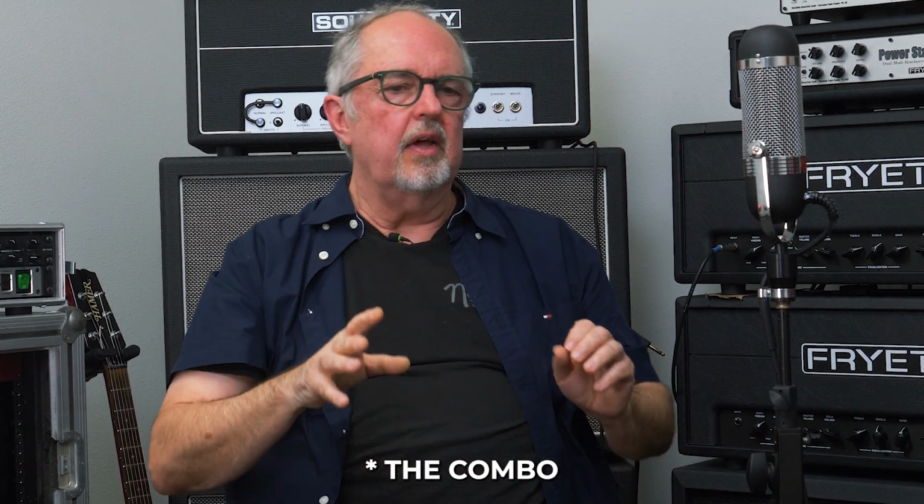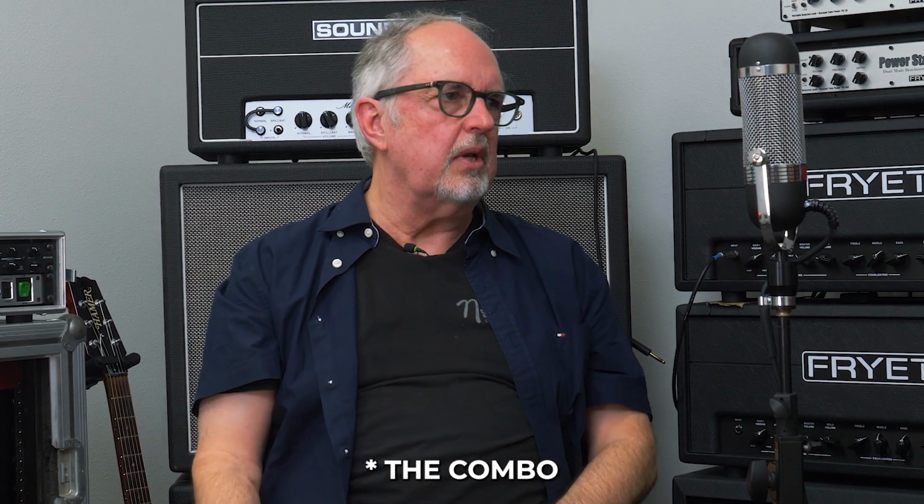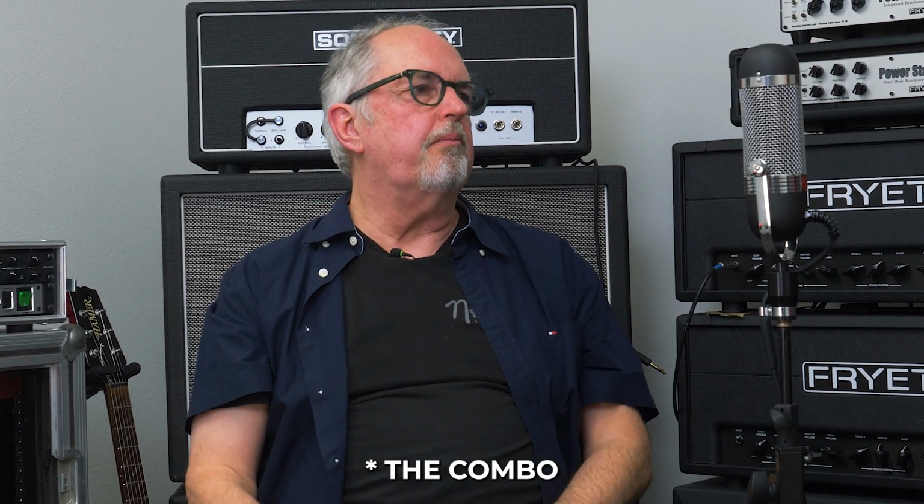And as always happens when you make a new amplifier, if you make a combo, somebody's going to ask for a head. If you make a head, they'll ask for a combo. So once the Pitbull head started moving under its own steam, we started getting feedback about it being smaller, which is kind of ridiculous. You just basically take the same size head and put it into a package with 2 speakers in it. By design it's an open back cab, or even if it was closed back, it would leak so much air that it would effectively be an open back. And therefore it would need speakers with higher power handling capacity, because there's fewer of them and there's air leakage, or they're open back and you're going to blow them more frequently, and they're not going to sound like 4 speakers in a 4x12 cab with a sealed back, and they're especially not going to sound like Greenbacks.